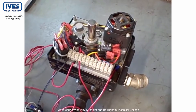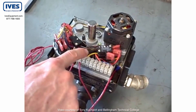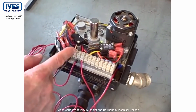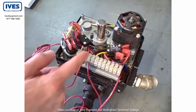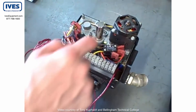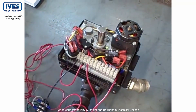Watch closely — I'll move the valve here. You can see one limit just cleared and these other limits are about to pick up. I want to go back the other direction — those limits clear and this limit picks up. Those limit switches tell the valve when to stop moving. If it weren't for that, the valve would just keep on rotating, going open and close, open and close, being a ball valve style.